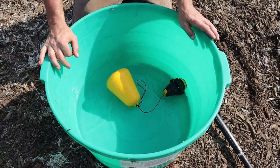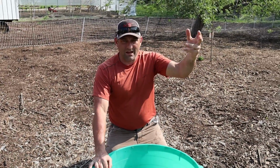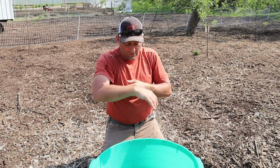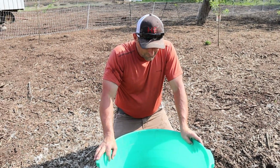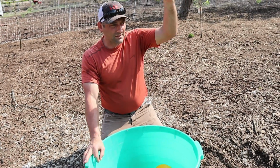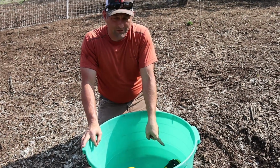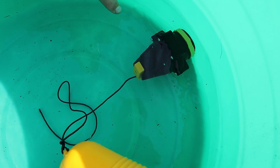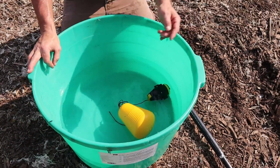So we did test it at static pressure, just basically at the actual tank. And it does have to have a little bit of PSI behind it. So it is a low flow, high volume, low pressure capability, which is nice. But with, let's call it a 5 or 6 foot elevation change here, we're able to get enough pressure where we see it filling right here. So it's filling from the bottom port, and we flushed it out so that all this debris came out first without going through the actual system.